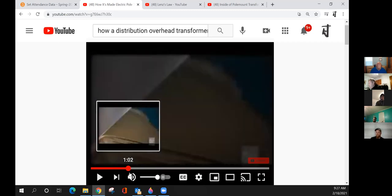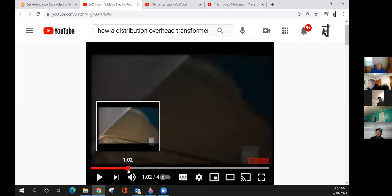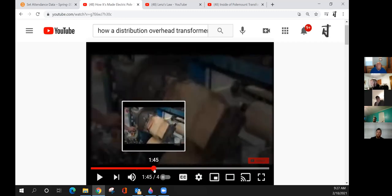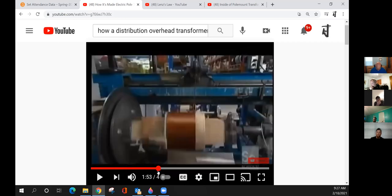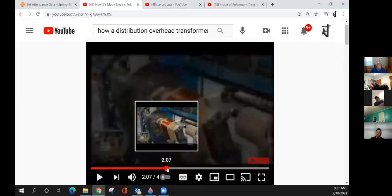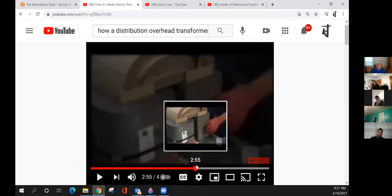I've told this many times, you've got to have a complete path on the primary and secondary side, right? So what are they using for the complete path on primary? They showed it when they were connecting it inside the transformer. I've got my primary coming in. Where do they take the other lead to? In the video, they showed them taking the other side, where our other bushing would be on a transformer like we have, and they took that lead to the tank of the transformer. So the tank of the transformer, and then the connection that you have on the outside is the actual primary ground.